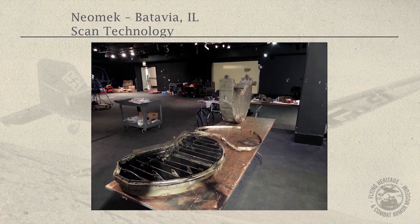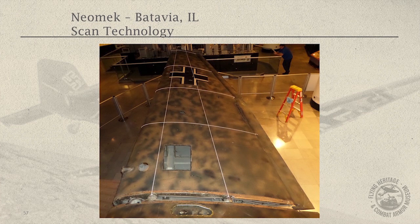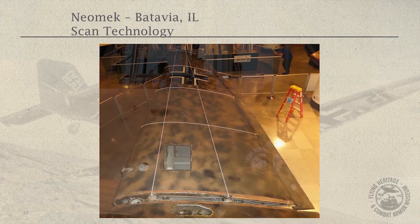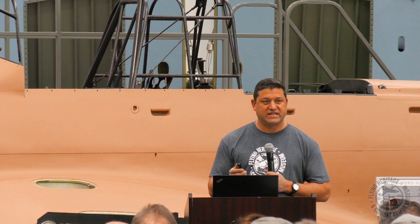Again, with the radiator cooling fins, we were able to scan those. We also scanned the entire aircraft all together, and with the fairings off. If you note in this photo, the white strings are just exactly that — thin ropes carefully run to critical structural components on the wing. The set of two lines are the wing spars. So when we scan that, it will show the exact location of the spars and where they are in relation to the rest of the wing.